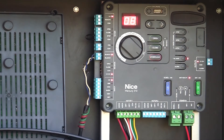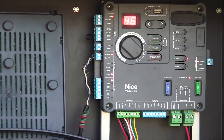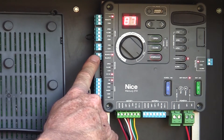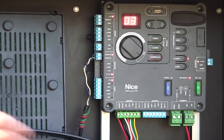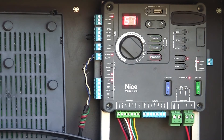I'm opening the gate. If I break the photo beams, nothing happens because they're set up for protection on the closing cycle. So if I close the gate and break the photo beam, the gate reopens. BlueBus devices are hooked up and ready to go. I can actually hook up six sets of BlueBus photo-eyes to this input — closing devices, opening devices — and I've got six different settings. Hook them all up to this one set of inputs, relearn the monitored entrapment inputs, and those devices are operational.